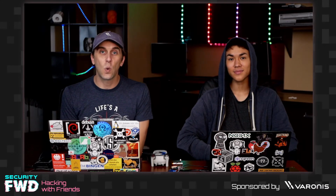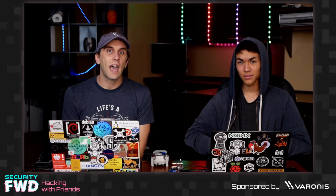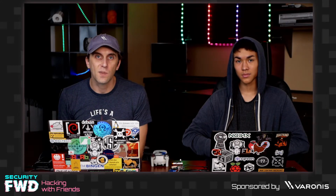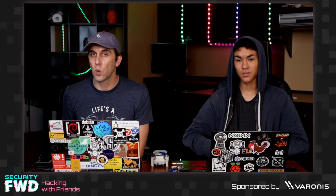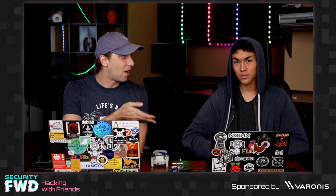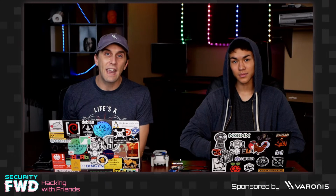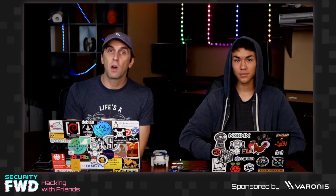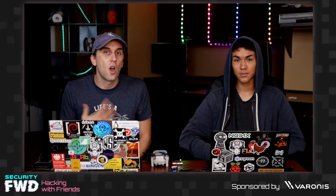Yeah, so this was quite the struggle to get up and in the air, but the scenario that we set up is we had one of our friends go to the opposite end of the park and turn on a Wi-Fi hotspot. The reason we did this is because currently this is set up to scan for access points, although, as you might have seen in one of Alex's videos on Hak5, it can also be turned into promiscuous mode, so it's just receiving any Wi-Fi packets, and in that case it would be able to identify smartphones in the area as well that were broadcasting, looking for nearby networks or specific access points.